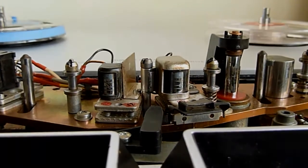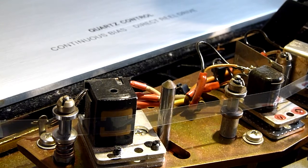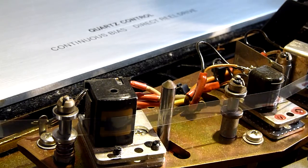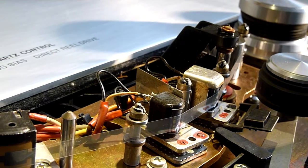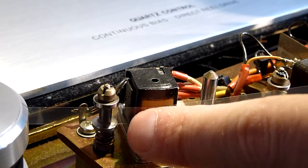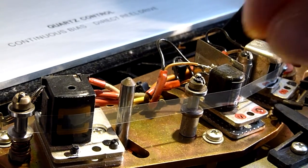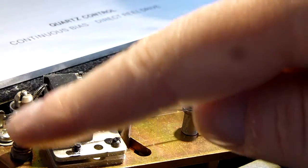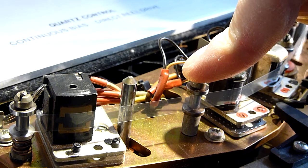This is what we see. Now I'm going to put some transparent tape on it. I've loaded the transparent tape — it's very visible to the naked eye, maybe not so much to the camera. Basically, you have to check whether this point is well positioned. This is the reference point. The manual says this is a fixed point on which the entire head bridge is built. This is not adjustable. This one is — as you can see, there is a spring here and a nut. This is the reference point on which you base all your adjustments.